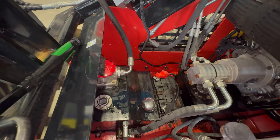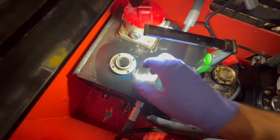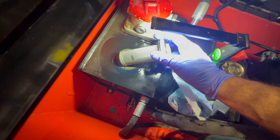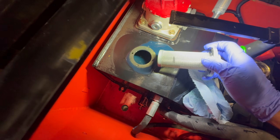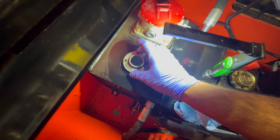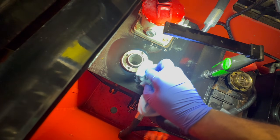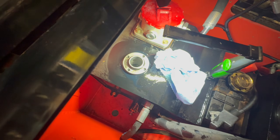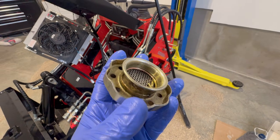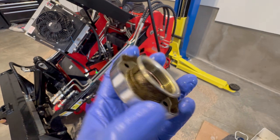Now I'd like to see where I am on the sight glass. As you can see, we're actually full on the sight glass. Looking at the contents of the tank, with our mark on the mesh filter, I'd say this is about 80% full — and about two to three inches down is your expansion room. So we have the correct oil level and the sight glass is showing full. For those saying to only fill to half or three-quarters on the sight glass — that is incorrect. As soon as the oil hits the level it needs, the sight glass will be full. If you're worried you put a little too much, don't worry, because the cap has a pressure relief built into it. If the oil expands and builds up pressure, it will release from the cap.